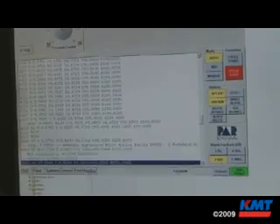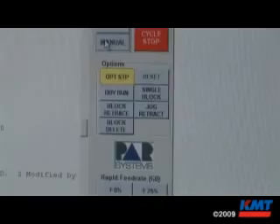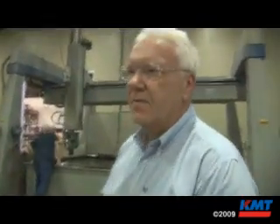If you had a spindle on the end of it, you could machine a basketball — that's true five-axis contouring. The system is an overhead gantry-style technology, giving you full access to the cutting table. It is very accurate — this machine will perform down to five thousandths or better in 3D. Absolute positioning means it never needs to be homed. Point transformation allows you to put anything on the deck and set your home. There's no homing required — every zero-zero point is set by the operator or programmer. A very versatile system.